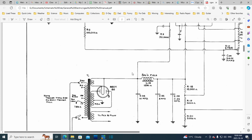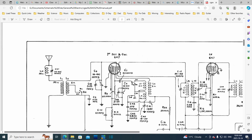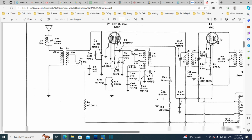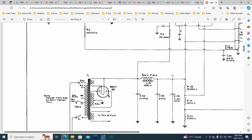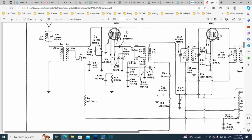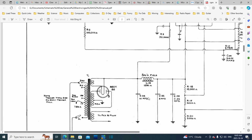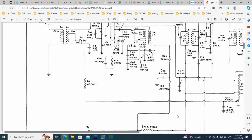Okay, and it's heading to what? It's heading to the first tube. So this is a very important filter. This first tube is very sensitive to things. It's intended to be sensitive to the signal coming in on the antenna, but it's sensitive to all kinds of stuff that can be amplified and shoved through the rest of the radio, including hums. It would be a different kind of hum here. It wouldn't quite be an audio hum. It might be an intermodulation hum, maybe.